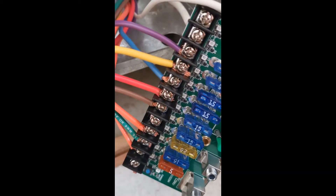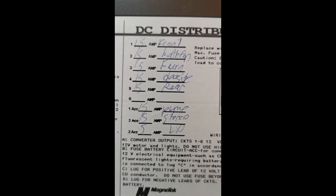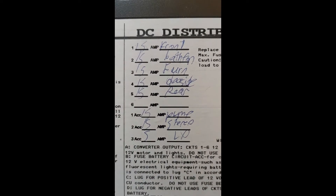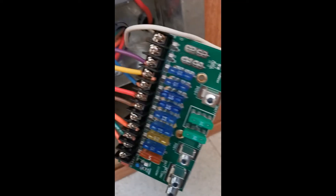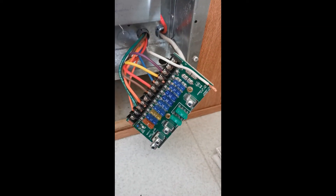I followed the sequence basically from my old to the new — looking at pictures I went across and rewired it the exact same way. So now the label is the same way; instead of one, two, three it'll be three, four, five — just continue left to right. I've extended my wires here. I had to pull this out through the back — it's got a compression lock I had to unlock and then feed a bit more wire through to reach the top of this panel.